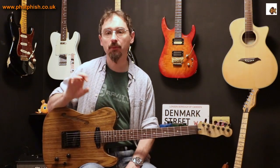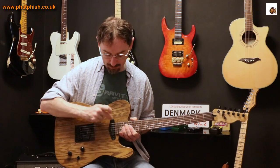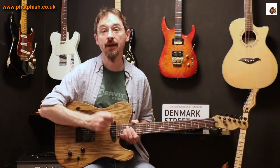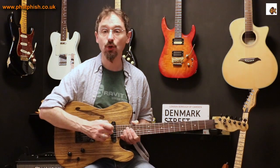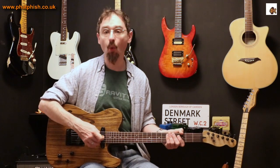Now if you're getting noise, these are humbucking pickups — they fit very nicely into a single-coil-sized aperture, but if you look closely there are two blade magnets, each one individually wound with a coil, and they're wired up as humbuckers. That gives you that characteristic fat humbucker sound. But the way these pickups are made, you can split them into single coils — what we call coil splits — where you take one coil out of the circuit, giving you a brighter, glassier sound. The reason humbucking pickups with two coils were invented was to get around the problem with single coil pickups, which are inherently noisy.